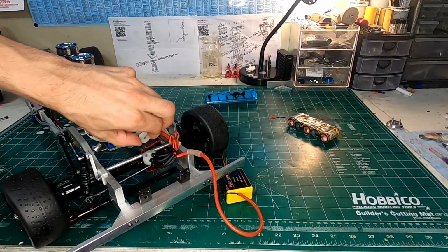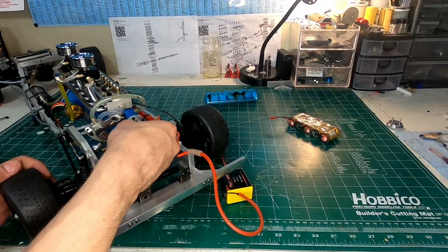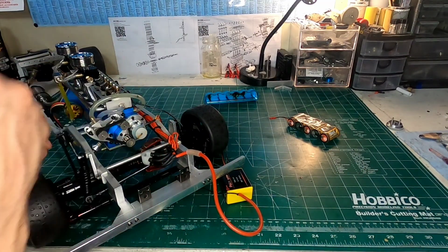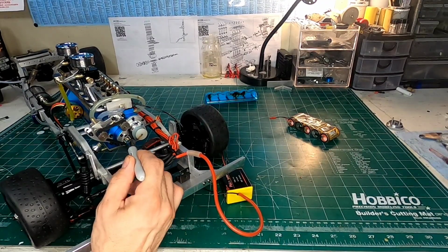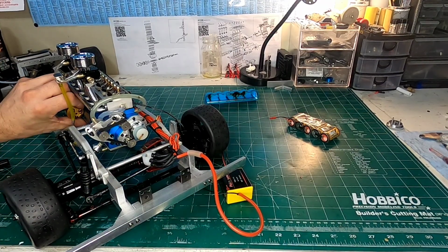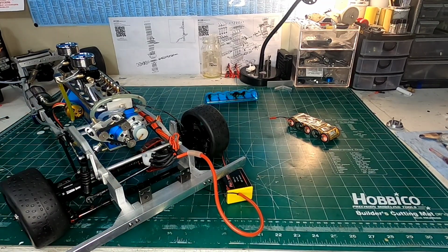So I know you have to have it right here, and I've gone through everything with this engine: the mechanical timing, the ignition timing, the valve timing, everything. I can tell you in a heartbeat where everything is going on this engine. I also have this marked in black here, and that tells me that I'm almost at my TDC. When this is over here, I am at TDC, when this is parallel or flat or horizontal to the ground.